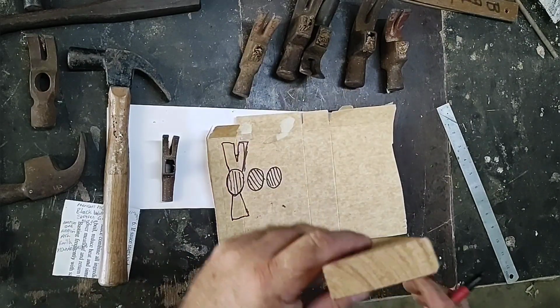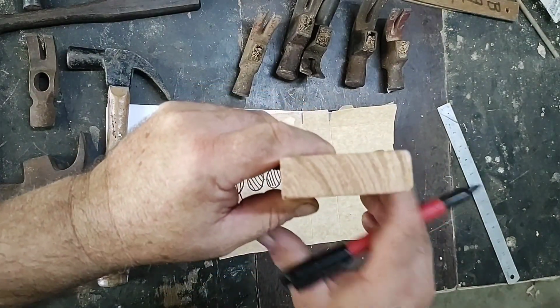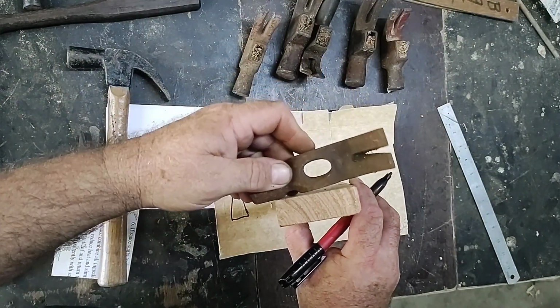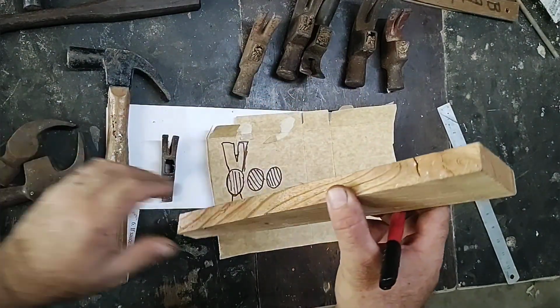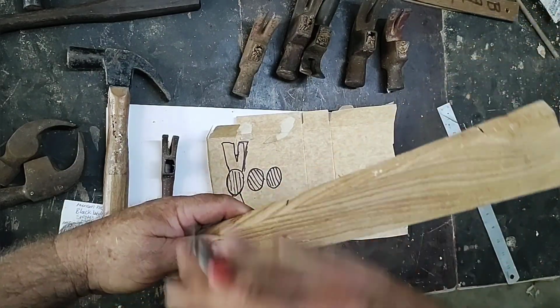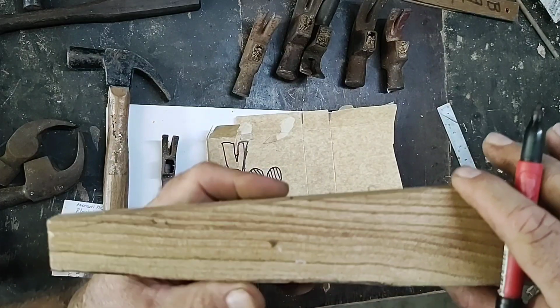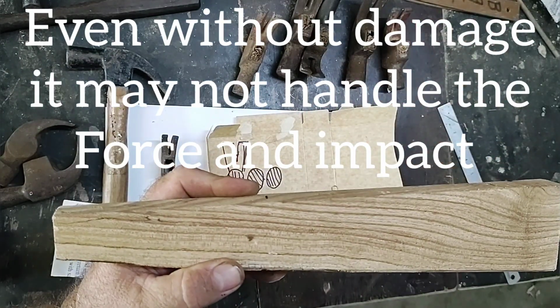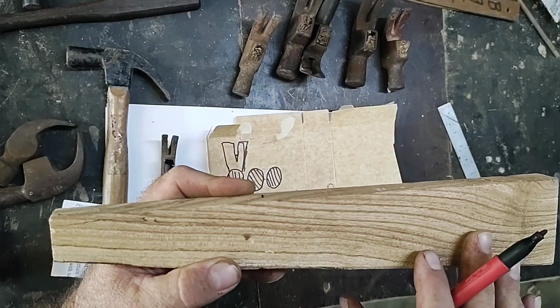So if I was to use a grain like that, in that orientation with the head facing like that on it, I believe over time when you hit here, say on the handle, that will splinter away. See these grains here, these fibers here, they will splinter away front to back, generally speaking. Yeah, it might have a bit more flex sometimes that way.